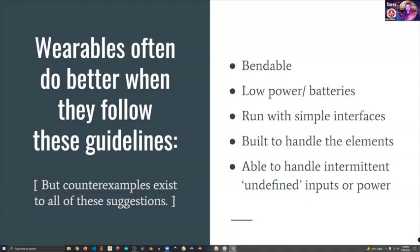If you do some sewing with conductive thread this week, I would recommend that you try and solder it together to have it a little bit more rigid, if it's the kind that will take solder. And if not, you can put a little clear nail polish over the joints and that can hold it down. But while you're doing that, you want to make sure that it's got a really good connection as the nail polish is going over, so it doesn't wick in and get underneath and break the connection for you.